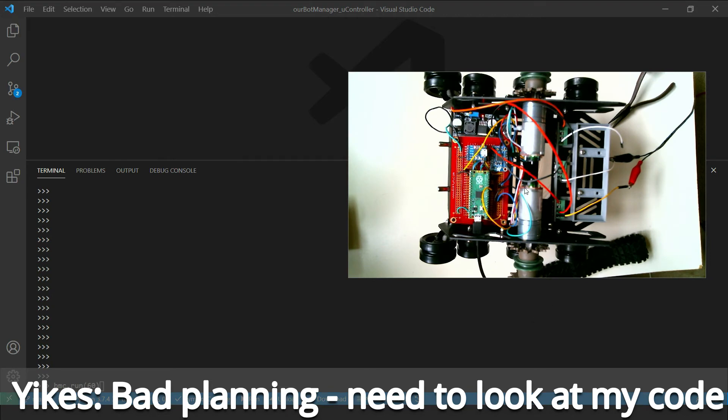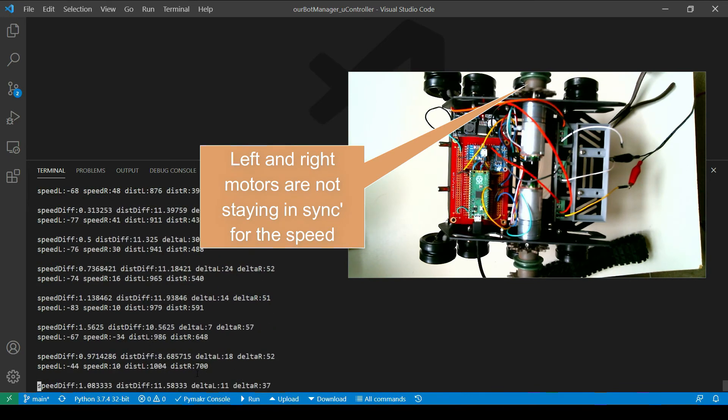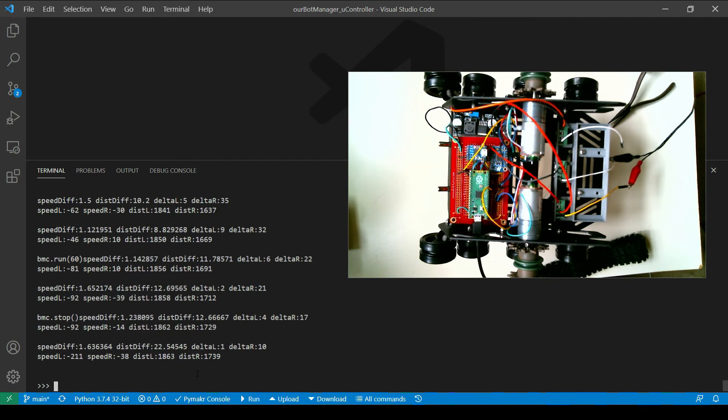So I realized what I was doing wrong. Different from my test bench, the motors are facing opposite directions in this base. So to go forward, they need to spin in opposite directions, which was different from how I'd set things up on my test bench. I just flipped the polarity on one of the motors. You can see there are some bad speed changes on the motor - I think that's because my speed adjustment routine was assuming both motors were going the same direction. I'll have to jump back into the code and adjust for that, probably in the next video. But at least now I know why.